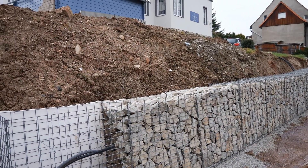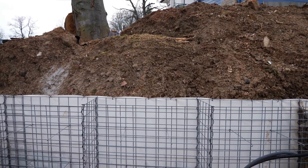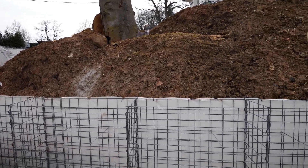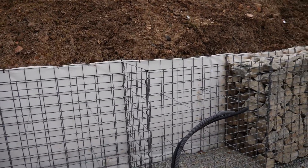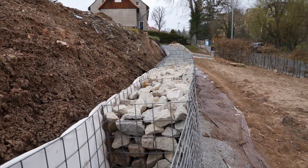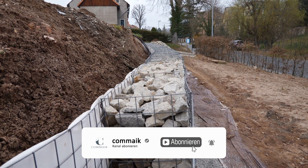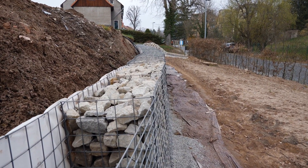To stabilize the slope you can see up here, the lower row of the gabions has been built. Here in this area it will be completely double layered. I want to bring the slope to the height we need, just below this tree stump. Originally, my first plan was to fill all the baskets down here completely and then apply the second layer. Unfortunately, a problem has arisen — the entire structure is noticeably bulging out at the back. That's not a problem; with the grid that will go on top it will be fixed. So I will now start building the second row of baskets.